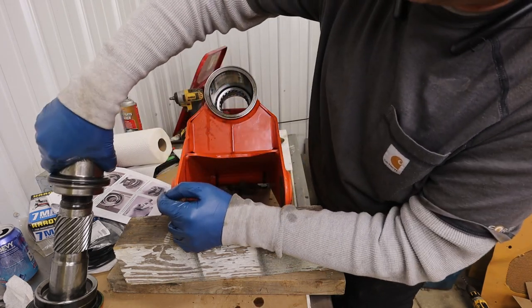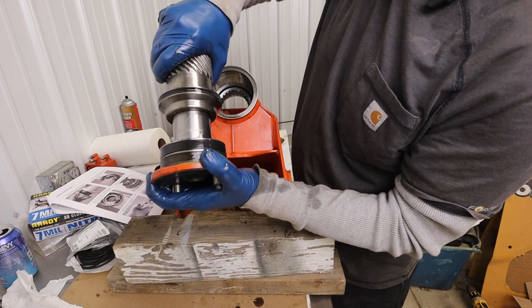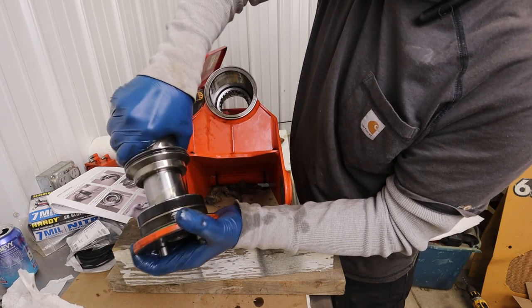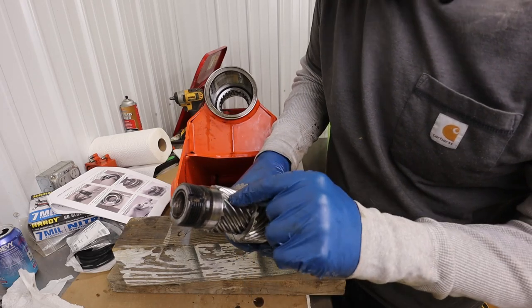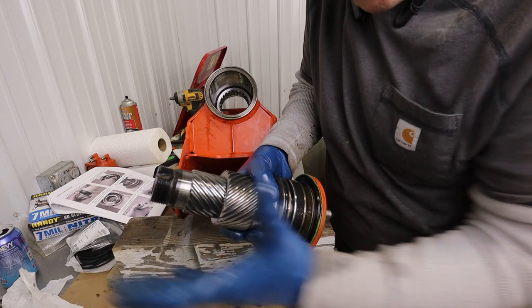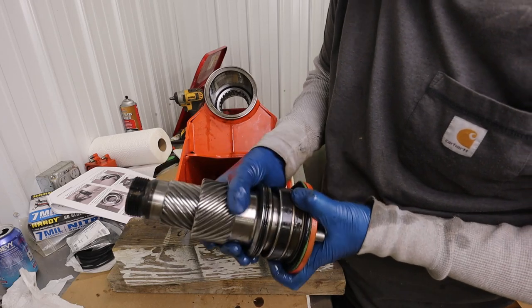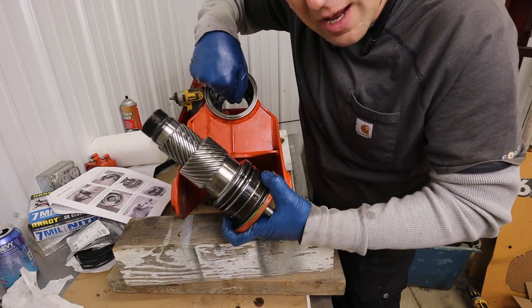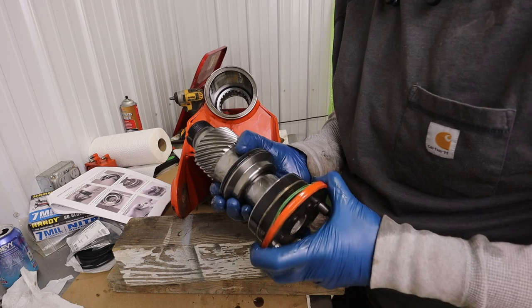So this goes down on there and seals right there. And as that piston comes up, it rotates on the shaft. Oh, jeez. And so what they're trying to ensure when you put this back together is that the teeth that were engaged between here and here are the same ones that are engaged when you put it back together. Probably because they wear maybe at different rates. So as this piston gets pushed, it rotates in relation to the shaft. Now, you couple that with the gear that's here on the outside, and when this piston pushes, this rotates. There's your rotary motion.